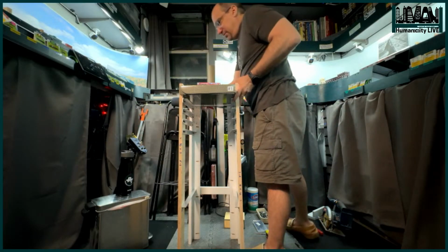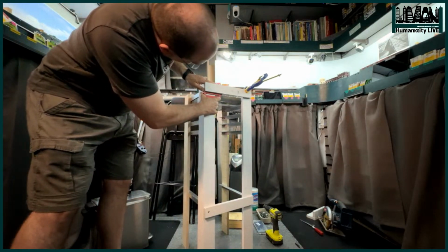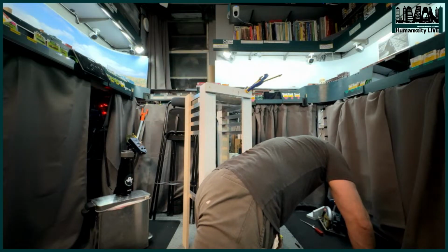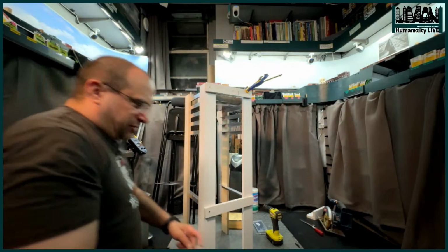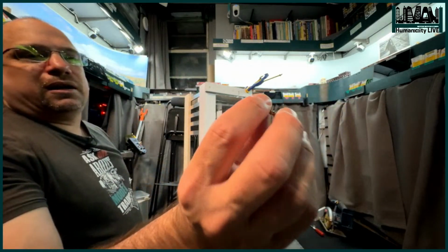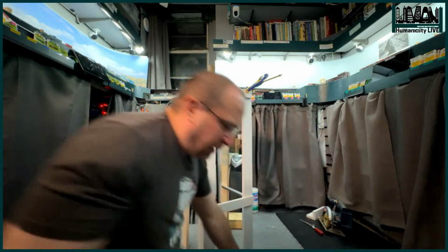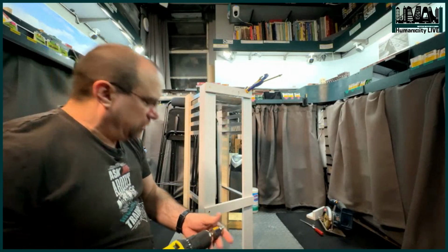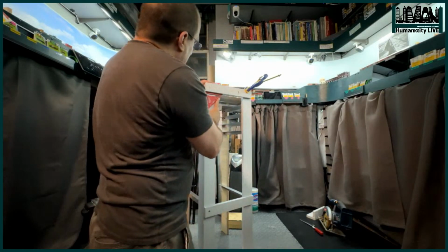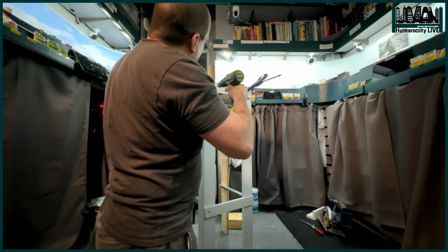All right, so I'm going to do this first. I'm going to square this side up. I know this is probably a great view, right? Let's try not to get this channel demonetized. I'm using these construction screws. They've got a star bit pattern on them, and somewhere I've got a star bit. I got a drill to put in a pilot hole. I'm going to check square. This is on the one leg that is already pinned. I've got 1 in, and I'm going to set this and put a second one in.